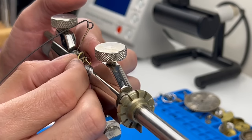The pallet jewel faces are each lubricated with a droplet of Mobius 941. I use the same technique to install the pallet fork as any other full plate movement. The fork is held onto the top plate with a piece of rodico and the plate is then lowered down onto the pillars of the main plate. I'll ensure all pivots are seated before proceeding. I'm using the lathe and a file to quickly make several brass pins to replace those that are missing from the movement. Each pin is reinstalled through their respective pillars to secure the top plate to the movement.